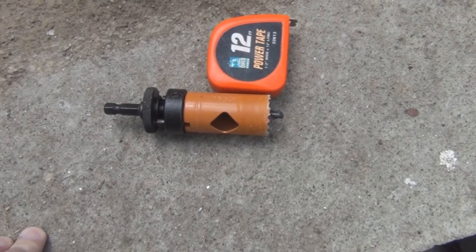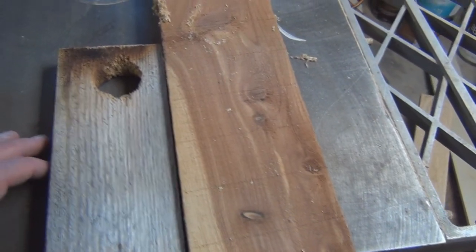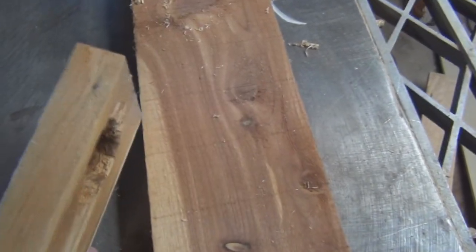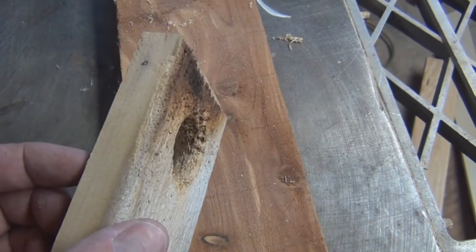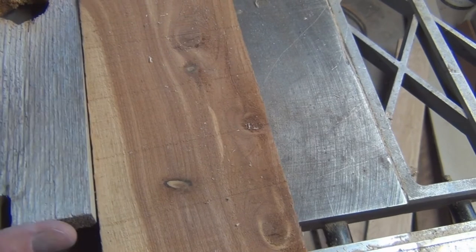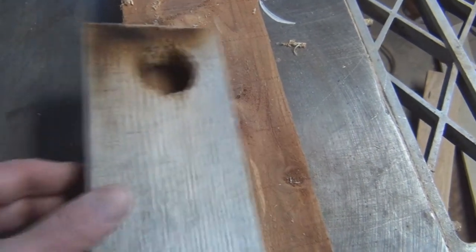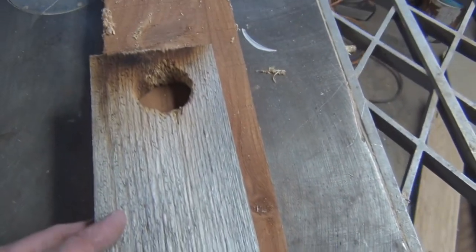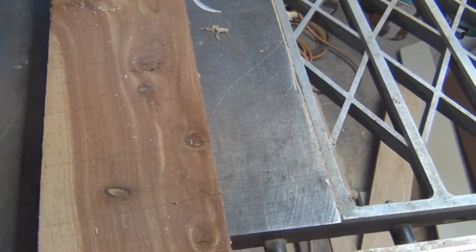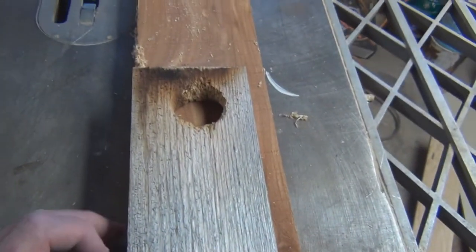So I have to find a piece of wood to use. I'm going to make this project a little bit more involved than I initially intended. I took the door off — I used a hacksaw to cut the pins that were used as a hinge on the top. But I have this piece of cedar sitting around. It's thicker, but if I use that I'll need to expand the hole through to the other side. I have to cut a piece that matches this, put a slot there, drill the hole — more or less one and a quarter. It shouldn't take too long. I'm going to rip this and then cut it to the right length.